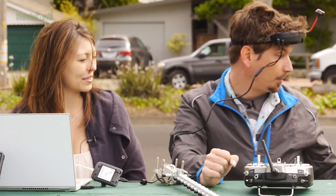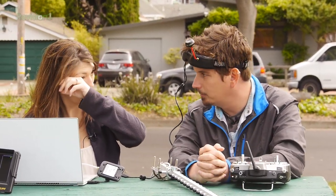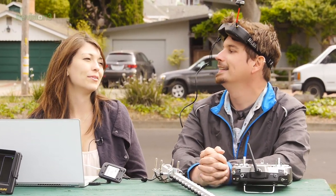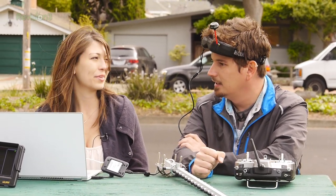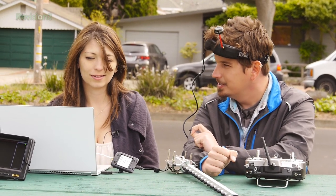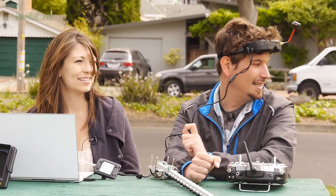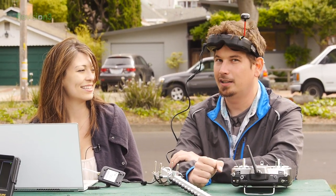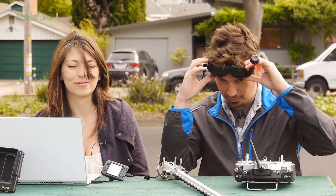In fact, I was really surprised because this is actually a carbon fiber frame. Yeah. And carbon fiber has a tendency to absorb some of those radio signals we'd like. Yeah, so I tried to keep everything away from the frame as much as possible. Still, I would say it wasn't an epic failure, it was a win, but we definitely need to make some upgrades before I can confidently put this at 400 feet. Definitely.